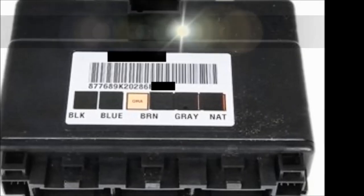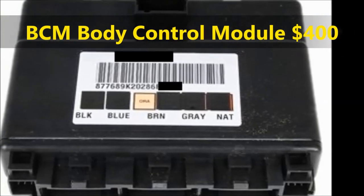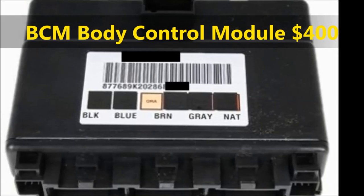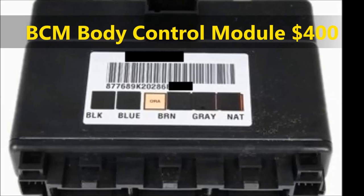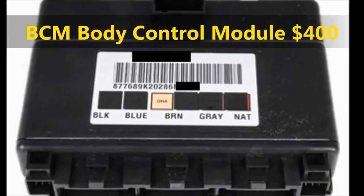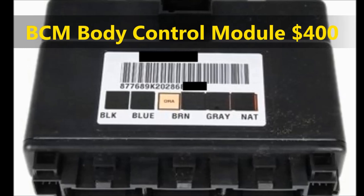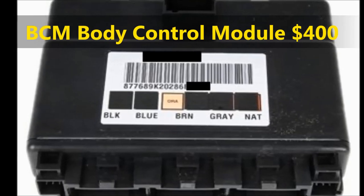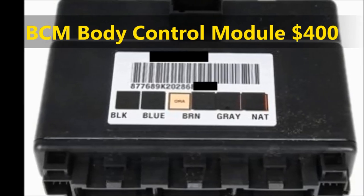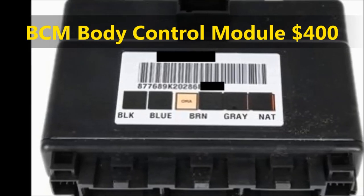This is standard now in lots of vehicles, but the idea here is for older vehicles or even for your own car. Lots of times the headlights are managed by the body control module. Body control module goes down. Sometimes the rest of it is fine, but it's just that the headlights don't work. And so this particular feature would bypass that, and rather than buy a body control module for $400, you can just implement this for under $20, and be done.